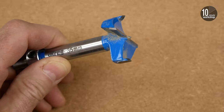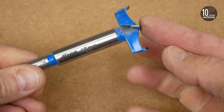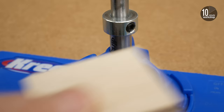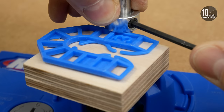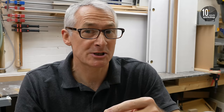The bit itself is a nice quality Forstner style bit — 35mm wide for standard 35mm cup hinges. It will drill a completely flat hole apart from a very small spike in the very centre. That spike adds about three millimetres or so to the overall height, so when first setting the depth stop, drill to your desired depth and then add three millimetres. As always, better to drill a test hole in some scrap material first before trying this on your finished workpiece.